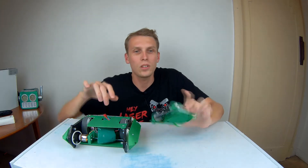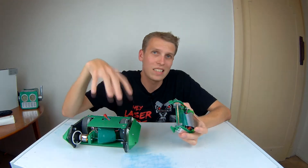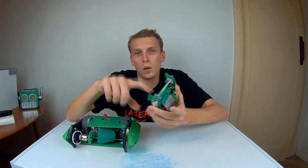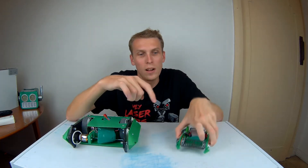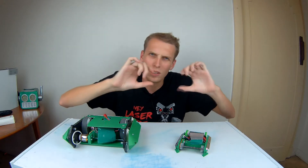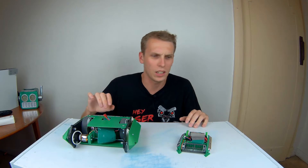The first upgrade is I added some little feeder wedges to the front of Don't Need Roads — and actually some of these suggestions came from you guys in the comments. The feeder wedges are there to get underneath an opposing robot and feed them up into the spinner. It also means that the spinner doesn't touch the ground anymore, which was really good, because the old version would touch the ground a little bit here and there, so I had to buff it up with tape on the underside to get it to spin correctly, which was always a touchy thing to do.